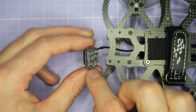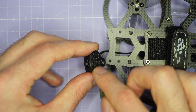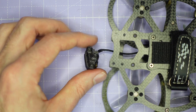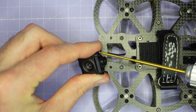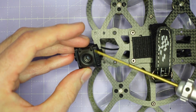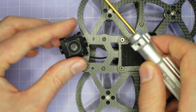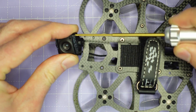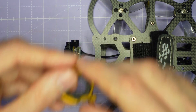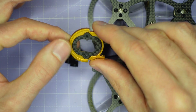It's very easy to strip out the plastic with the screws that DJI provides, so just try to avoid that. Once you have those four screws installed correctly, the top of the screw should come flush with the plastic adapter — that means you've got it perfect. Once all the screws are assembled, double-check that you haven't got any gaps between the adapter plate and the side of the camera. The camera cage assembly is exactly the same for the O4 standard camera as for the DJI O3 camera.